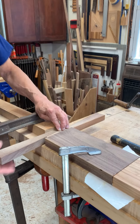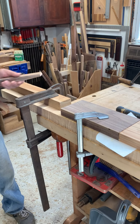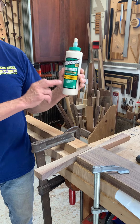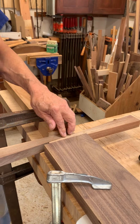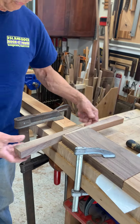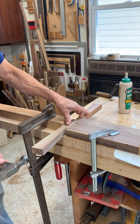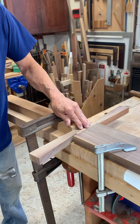Underneath this piece is sandpaper so it doesn't move, and I have some really heavy clamps on there. I'm using Titebond glue because it has a longer open time. I've already pulled this together really tightly and started letting it dry, but I wanted to show this process, so I cut two wedges and I'm putting them in.